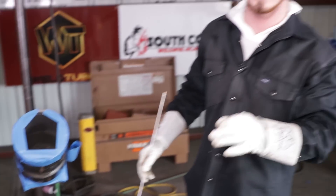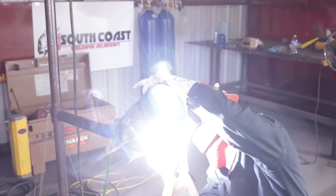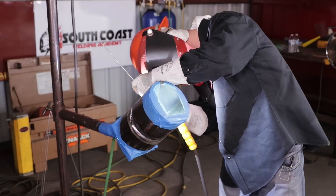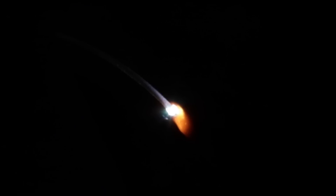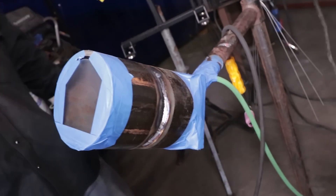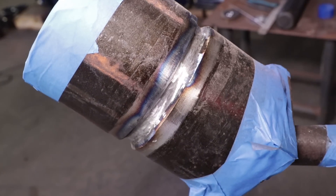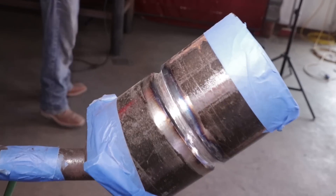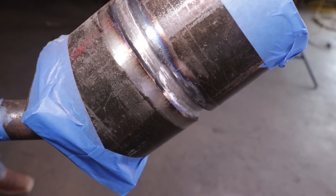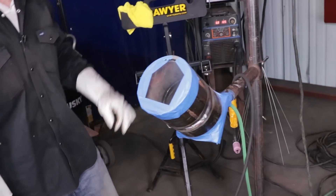Just finished up the right side. I'm gonna come over here and do the left — it's just the same, on the opposite side. You're always trying to keep that rod on the inside of the pipe. If you start running on the outside and feeding that puddle to the outside, you're gonna have a flat root. We just closed up the root, closed that tie-in, and what we're gonna do is go ahead and clean it up with the grinder on the outside. Just grind it down real smooth — you don't want to grind in too much and burn into that root pass and blow a hole. You just want to clean it, get a nice white shiny metal, because it's a very dirty rod.